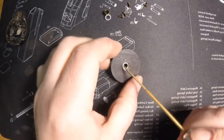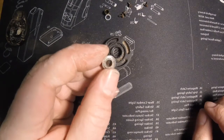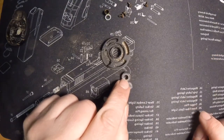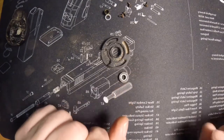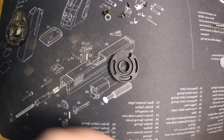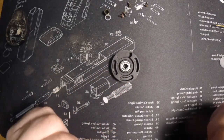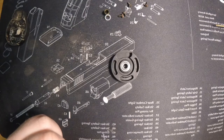On this top plate you're just going to want to remove this bearing here, and it's probably going to be trashed if you've never serviced it before. I'm going to go ahead and just replace it because I have extras. I use the high-speed bearings on this just because it's going to be spinning pretty fast. I also use the steel-encased ones because it will most likely be experiencing some heat. I went ahead and cleaned this end plate up off camera. I probably didn't have to replace this bearing but if I'm already in here, why not — these bearings are cheap.